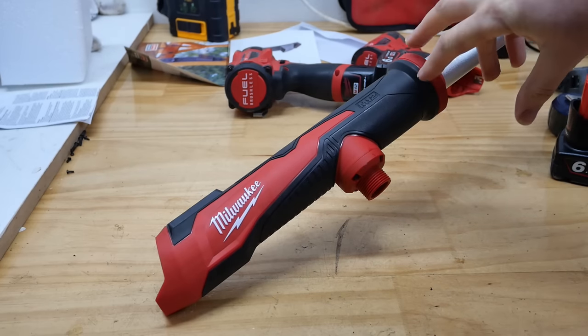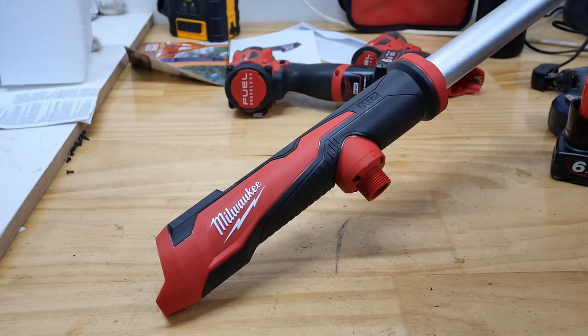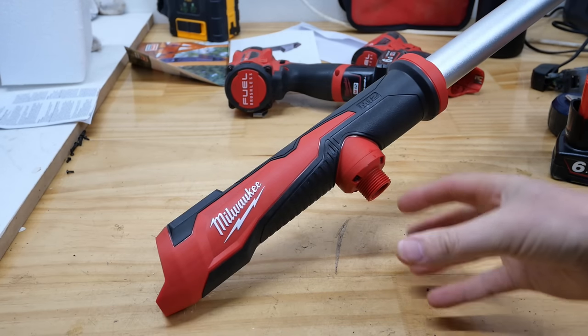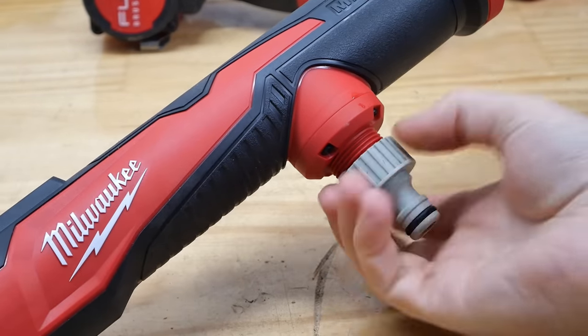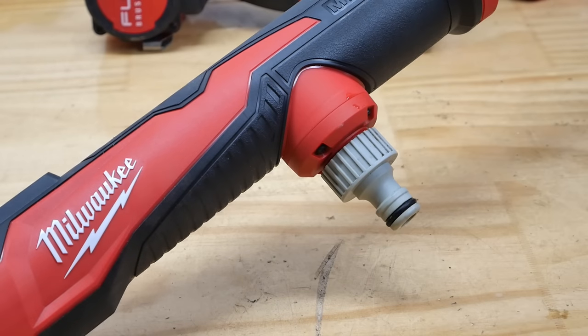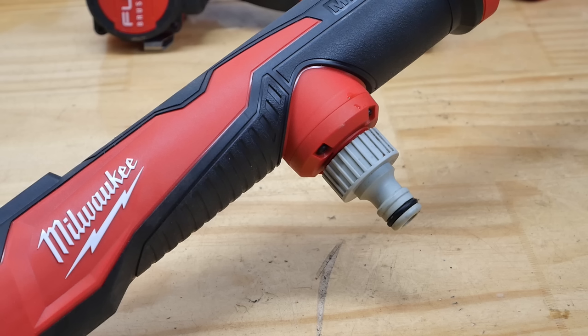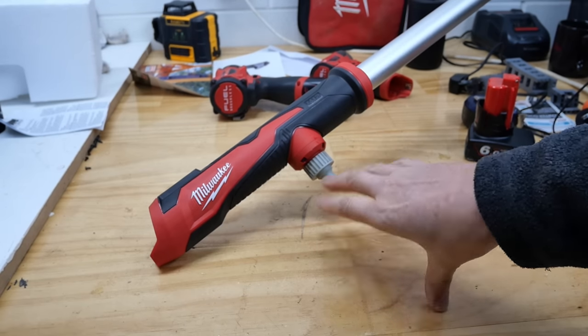So like I said, it's brushed, not a fuel model. It can transfer 34 litres of water per minute, or about nine gallons, and it has a 4.6 metre head on it, which is pretty impressive — or about 15 feet. It's designed to attach a 19 millimetre standard hose fitting, or three quarters of an inch. Just screw on your hose fitting, clip on a hose of any size that'll fit on there, and away you go. You can fire water wherever you want it to go.